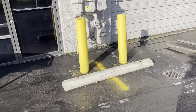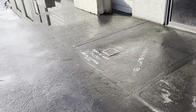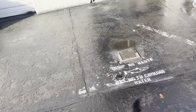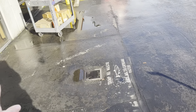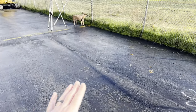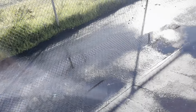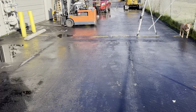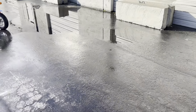We can just saw cut around there, remove the wheel stop, and then these drains are going bye-bye — we'll take these drains out. They do flow, but we want to take them out. This is a good example right here: you can see how it's humped up on the back side. We're going to continue that slope all the way down until we get to flow line. Right now it slopes all the way up, so the highest side is where we're going to take out the most dirt. We can cross-slope in at whatever rate we want, but I'd probably try to stick to something similar to what we had on the other side.